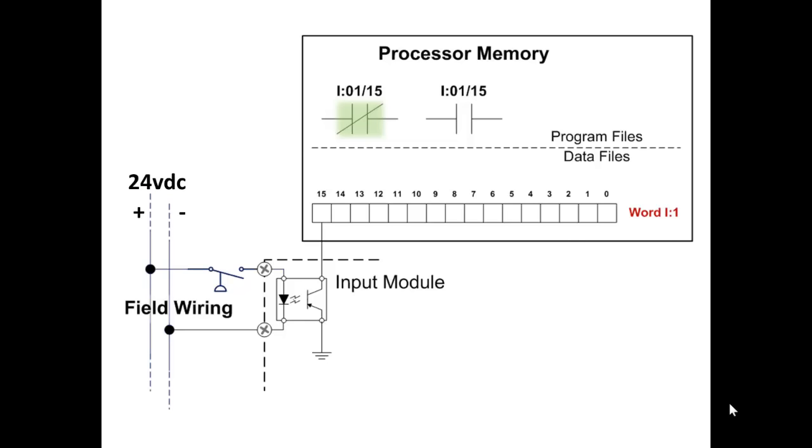So look this over closely. You still have your pressure switch. It's still 24 volts DC. Another inclusion here, if you will, the row of yellow relays in our original relay panel was the electrical interface between the field device voltages and the voltage on the panel.